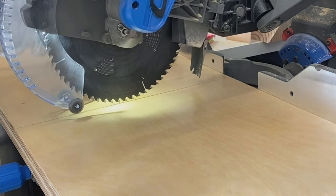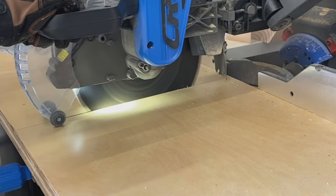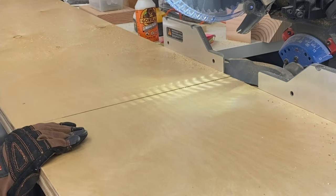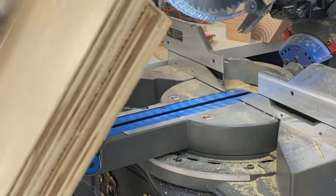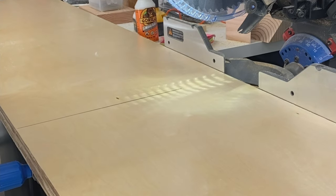I am using three-quarter inch pre-finished plywood. I'm doing this because I will not be painting the plywood — I'm gonna leave it raw like my inspiration picture, and this has been really cool to work with. It's somewhat shiny and very smooth. I liked working with it. Now each of these pieces has already been cut to the depth that I wanted — they were ripped down to 16-inch strips and now I'm just cutting the length.